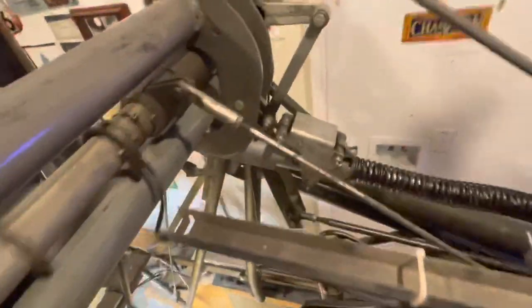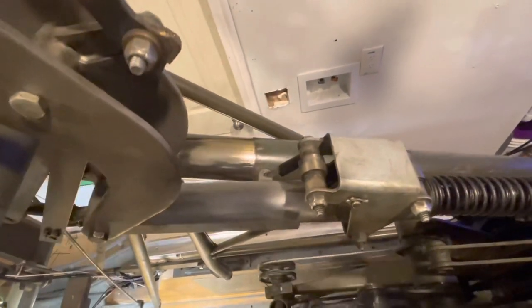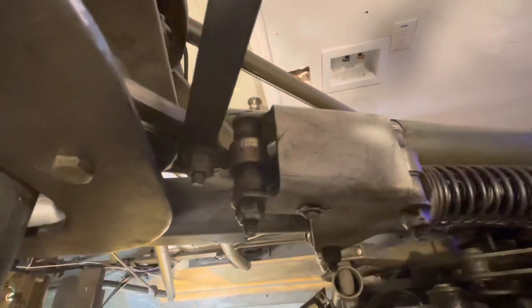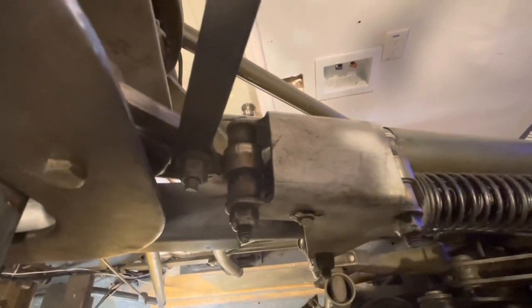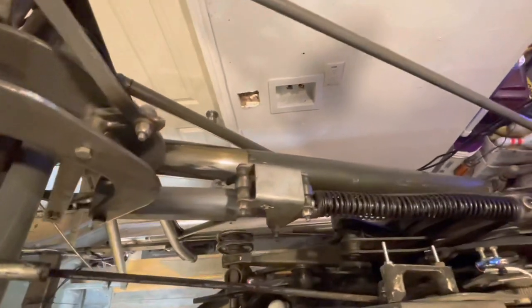The deck holding hook is that big metal hook out there — you'll see that on second ball. See the inner pulley turning here — that actually runs the scissors. This is the rake release mechanism. That little hook right there hits that guy right there and will release the rake to make it drop. If you see it come down, there'll be about a penny-width of gap in between the two. When you throw a ball, the piece on the left hits the piece on the right and releases the rake. Then it locks back in place when it gets all the way down — now it's a solid bar again.